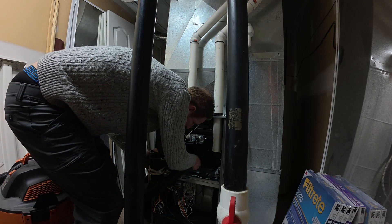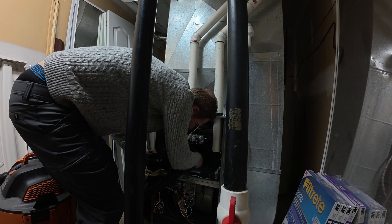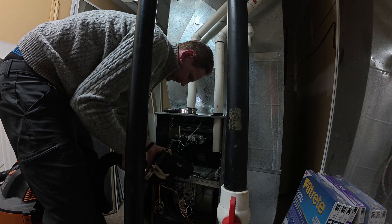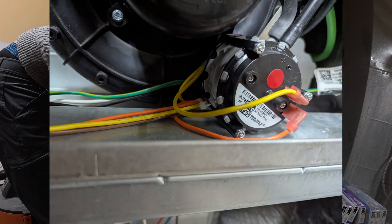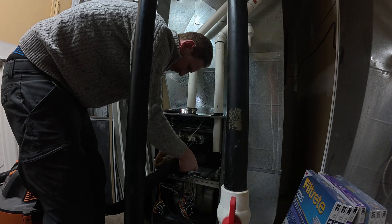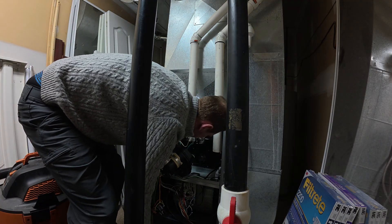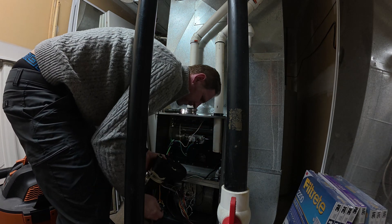After doing this procedure I had the furnace shut off multiple times. Anyway, after sucking all the water out of the various hoses and areas, that water creates a problem for the pressure switch. One of the important jobs of the pressure switch is to make sure nothing is blocking the exhaust of those dangerous gases, because then you get CO poisoning — that's not something to ignore. If water gets in there, it affects the pressure switch and makes it think something is blocking the CO exhaust, when in this case it was just water messing with the pressure measurement.